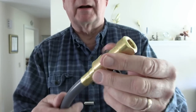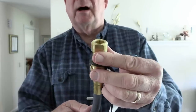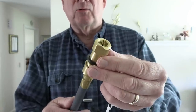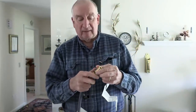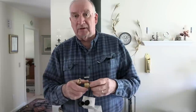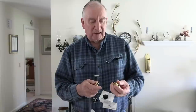We're going to be running some black iron pipe — it's steel pipe, but the traditional term is black iron. I've calculated that the length of run I have should be at least 3/4-inch black iron pipe for most of the run and 1/2-inch pipe for the remaining 20 feet. This gas grill runs very close to 100,000 BTUs with all burners running, so it's a massive amount of gas consumption.